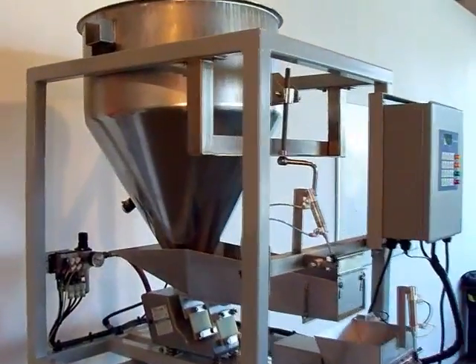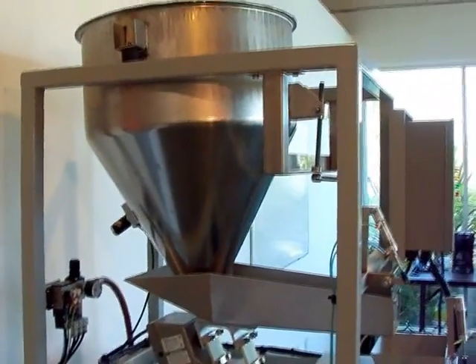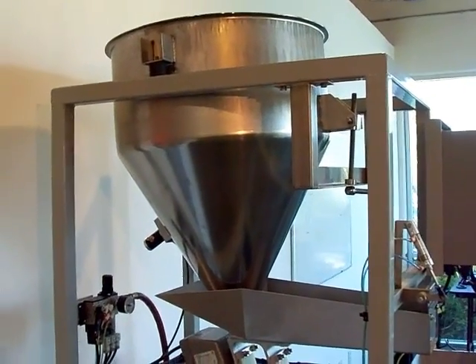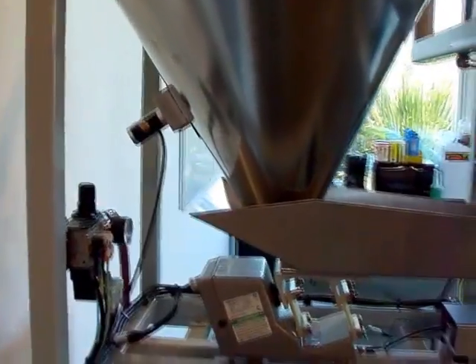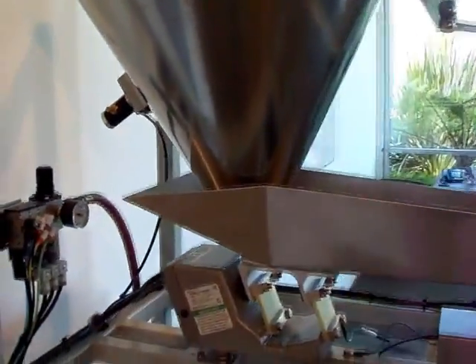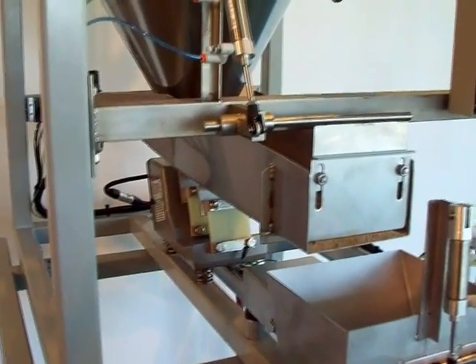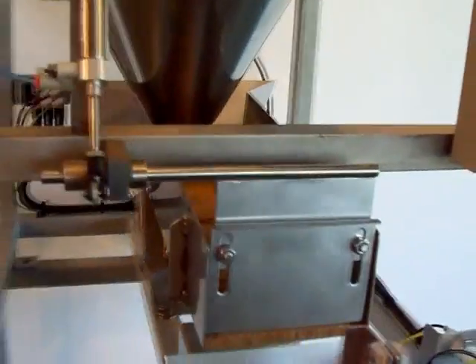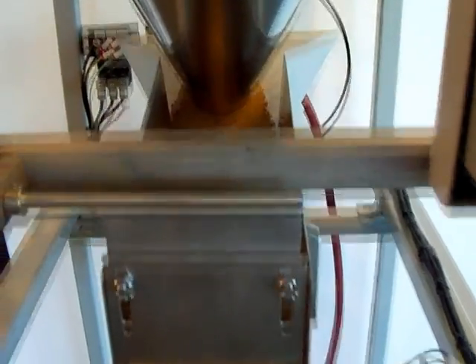What's new for 2011 is we have a new conical hopper design. This assists in the difficult powder flow and also helps to keep any residuals out of any square corners. It's equipped with a hopper vibrator on the back which can be turned on and off depending on if you need it. The feeder pan has also been modified — it is the straight sided feeder pan which assists in the product flow, makes it faster, and also eliminates accrual.